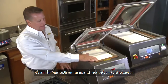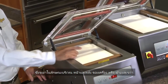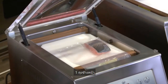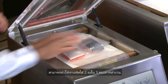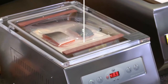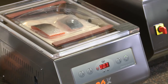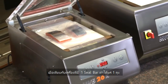A double bar machine is a vacuum packaging machine with a seal bar either in the front, in the back, or left and right. What that allows you to do — so if I was doing these fillets — is actually have one bag in the front and one bag in the back, giving you a production of two per cycle. Versus a machine that has one bar where you're doing one bag, here I'm doing two.